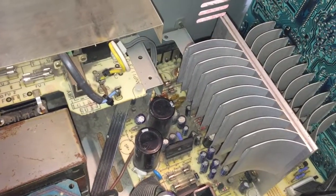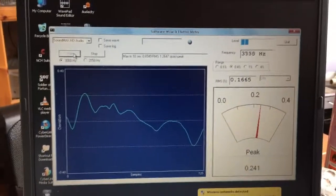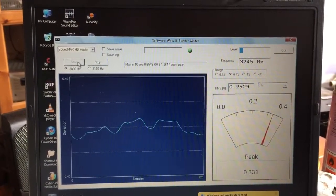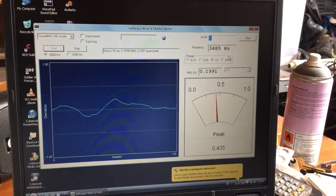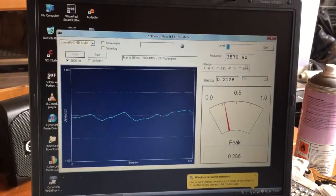So at the moment it's looking good. I'll let it play for a bit longer and then I'll come back to you. So with my cobbled-together red RCA jack thing into a computer, we now look at how stable the speed is — it's definitely running fast. That's running about 0.4% peak, 0.2% RMS — that's very fast.